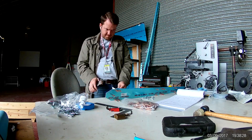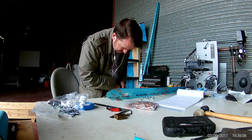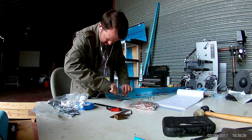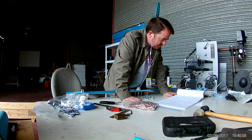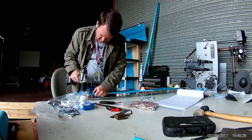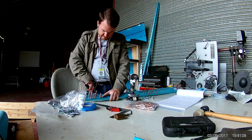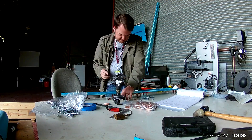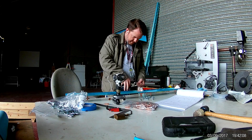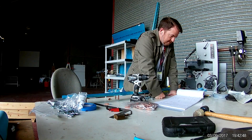One of the things that I've been thinking about as I've been continuing in this build — because I'm way past here by now obviously — is the nature of deburring and cleaning metal. One of the very first things that you learn is how to clean properly, prepare edges, holes, or fastening surfaces. You must not have any sharp edges, you must not have any burrs. Vibrations lead to cracks, cracks lead to failed parts, and failed parts lead to failed flights.